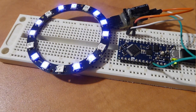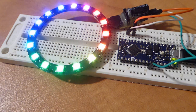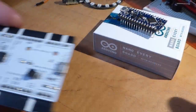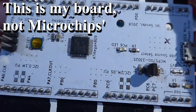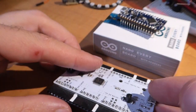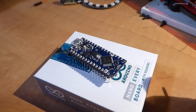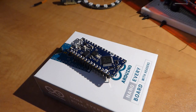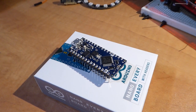So in conclusion, should you buy an Arduino Nano Every? No. If you're an absolute beginner, you'd be better off with the tried and true Nano and the existing resources for it. If you're more advanced and want to play around with all the cool features of the ATmega4809 itself, it would make more sense to get one of the evaluation boards offered by Microchip, or even spin one yourself. There's only a narrow range of applications where it would really make sense to get the Nano Every. Of course, if you just like new stuff or want to support Arduino, knock yourself out.